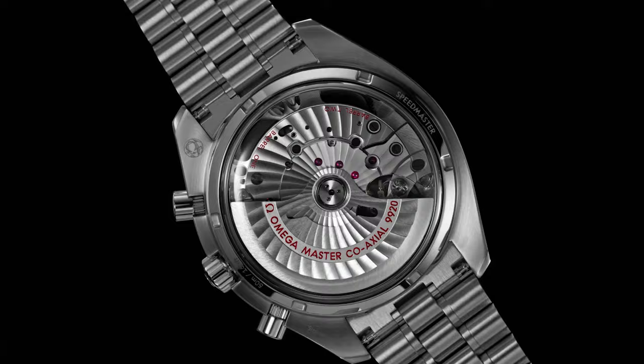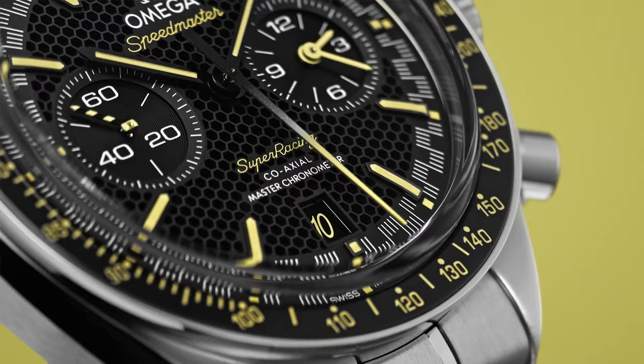But there's an issue with a free-sprung hairspring. The biggest problem is that when you're changing the weight, you have to be hyper-precise, really, really precise. Because otherwise, the differences can be pretty big. Even if you're off by a fraction of a millimeter, it's gonna impact the rate of oscillation massively, because you can have a heavier weight on one side, you can have a heavier... You get me. Did you understand that English, Terry? I got you. That flawless English? That brings us on nicely, I think, to the Omega SPIRATE system.